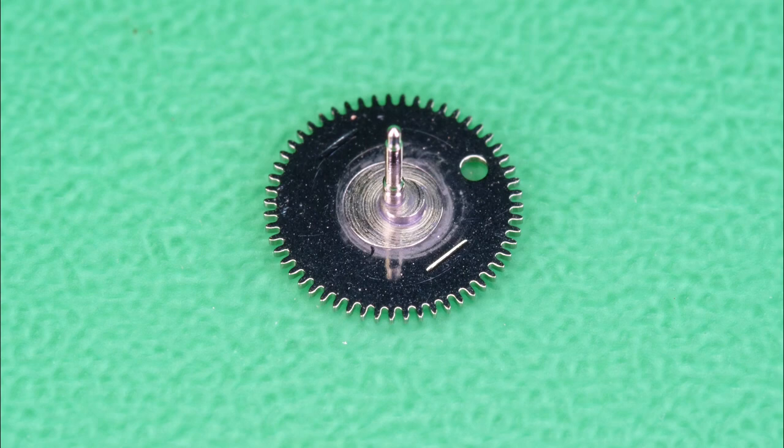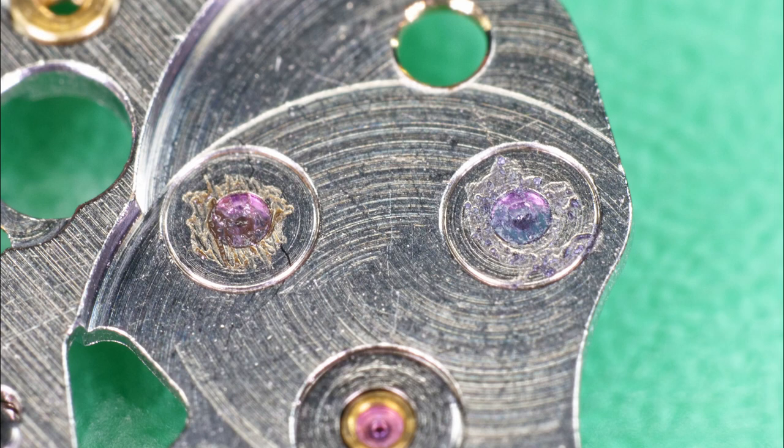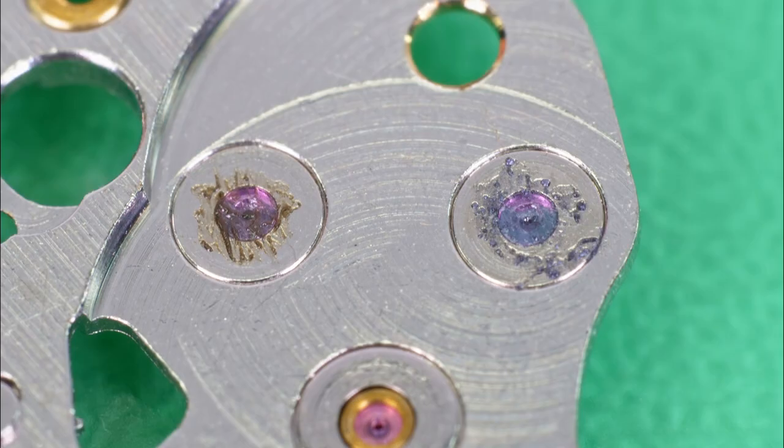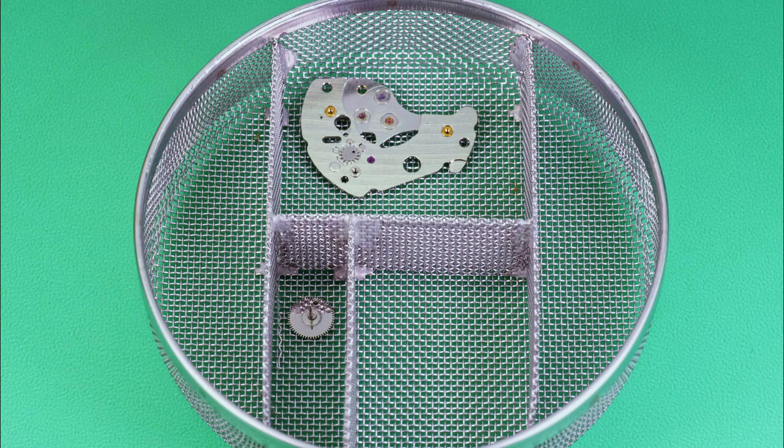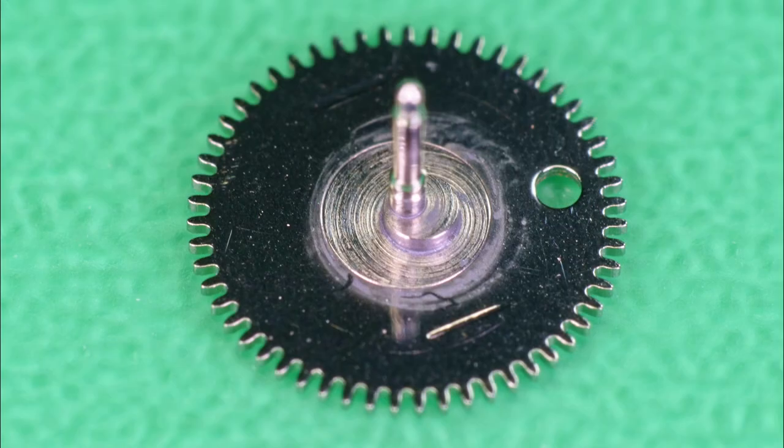I have several of these inexpensive movements for testing and parts. The S4 grease is thick and sticky, but this is not even a used movement. I put some Kluber P125 grease on the jewel on the left, and some Seiko S4 on the jewel on the right — in the jewel holes and even between the jewels and the plate. I'll use the same solutions and follow the cycle in the Elma manual. And that came out spotless — so fresh grease, no problem at all. But the reduction wheel remains the same.